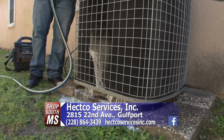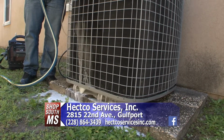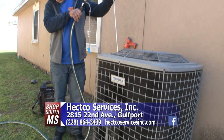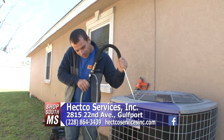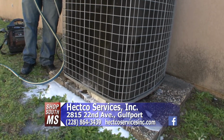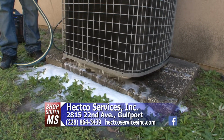Now, a lot of people think that they can just take a water hose and wash it off and it's fine, but that's not true. Because you have dirt and stuff that gets hung up on the fins, and with the system that we have, watch out, there's water spraying out. It's going to push it on out, and then we come back with the hose and rinse it out real good, get all the chemicals that we put in there out of there. That is the way we clean it from the inside, and then we'll show you how we clean it from the outside in.